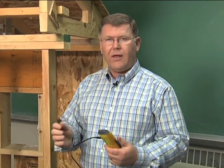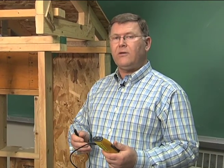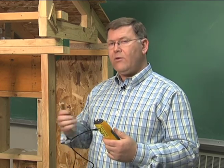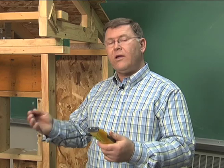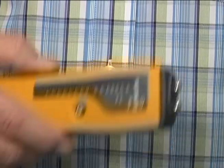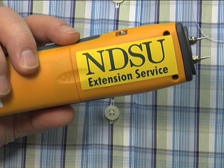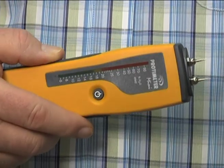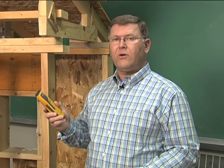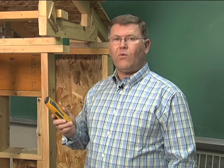It's very simple to use, but it gives us very important information — whether that structure has adequately dried for rebuilding. We don't want to enclose the wall cavity or we'll end up with mold growth, and even within the wall cavity, air exchange brings that moldy environment into the living space. I encourage you to check out one of these moisture meters from the NDSU Extension Service county offices or your local office, or from a contractor. If someone else is doing the work, make sure they're checking moisture content of building materials before closing that wall cavity.